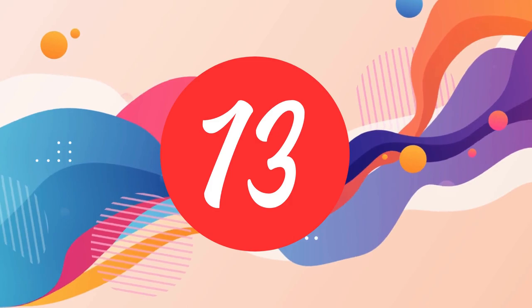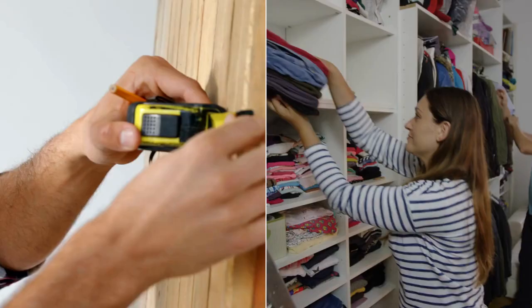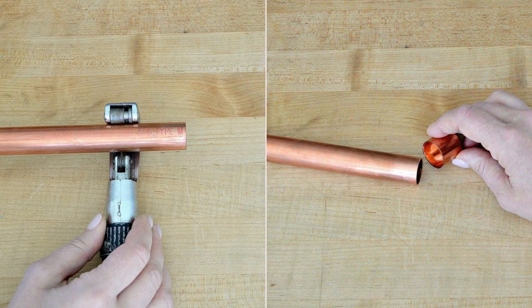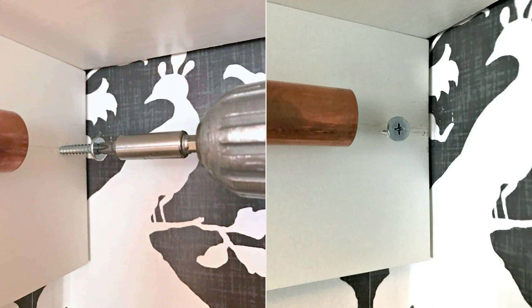Number 13: Transform your closet with Christie's stylish DIY sliding rod idea. To begin, add a touch of glam by spray-painting visible wood screws with copper, then measure the space from your closet's back wall to the trim and cut a copper pipe accordingly. Smooth the ends with a file. Pop a copper tube cap on the exposed end of the pipe, then mount copper tube straps, spacing them evenly. Slide the pipe in and add washers as spacers if needed. Finally, prevent wall damage by discreetly adding a small screw.